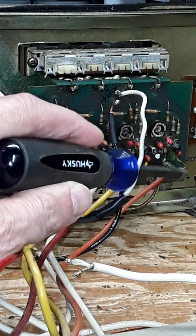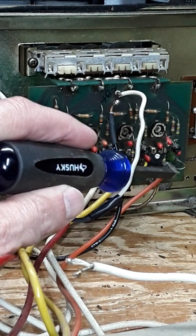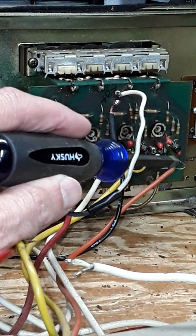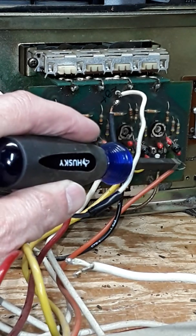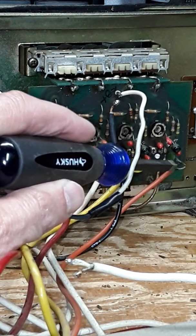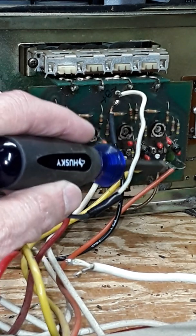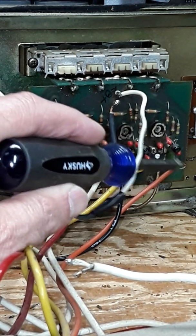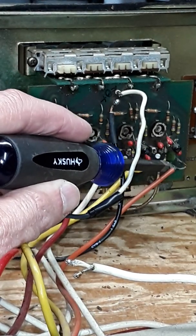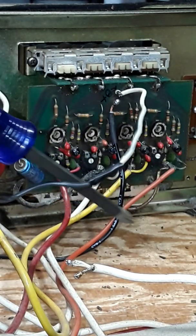Nothing wrong with it. This orange wire, on the other hand, is exactly what I'm talking about, and you can see a little piece flaked off right there as I'm touching it. This center conductor insulation looks brown. I don't know if that's how it was in the beginning or not, but this is old wire that needs to be replaced. You can see the insulation is flaked off here, and this green color is the copper wire on the inside, which is corroded severely. And then here's your braid. When all of this flakes off, a new person who hasn't worked on Binsons before can easily confuse the braid with the center conductor because you can't tell the difference.